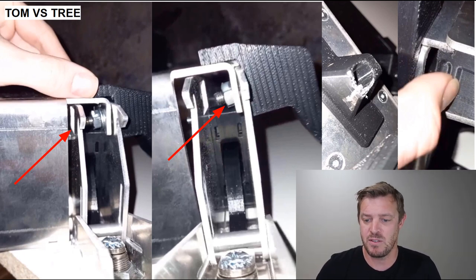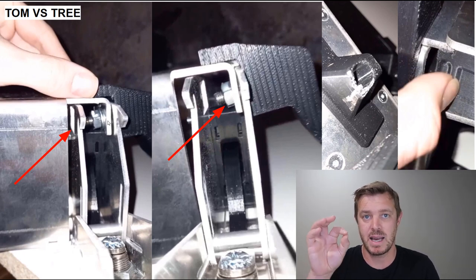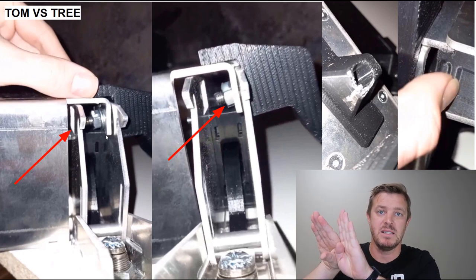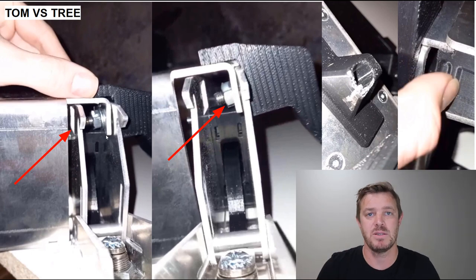We also found out that the closing mechanism there was a bit damaged from the whole thing. But great, we found out that these parts bend and it's harder to open. So what we're going to do is introduce some slight cuts, so if it does start bending, it's kind of sheared, so only one part bends and the other one stays solid and straight. That's how we're going to solve that one.